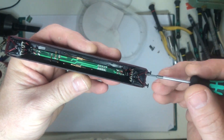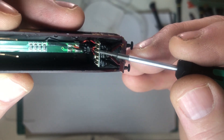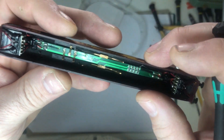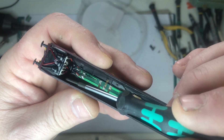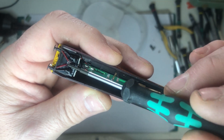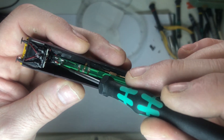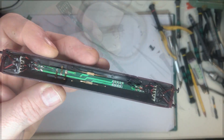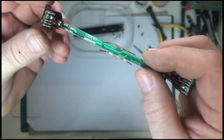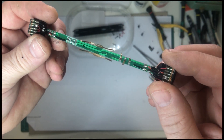Here's the printed circuit board in the roof of the loco. You can see the black where the white light goes through, then the reds either side - so two white lights and a red in the middle, plus another white light at the bottom. There are resistors, two contacts that have to go, and three connectors for day and night running that have to go. Then there's a light at the other end with two white lights either side and a red LED through the middle. So we have to cut those out - they all pull out nice and simple. I'm going to cut that printed circuit board, take all the wires off it, and completely rewire it - it's much simpler to do that.